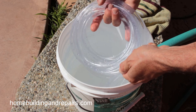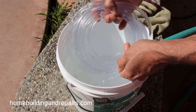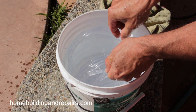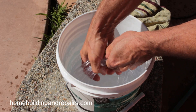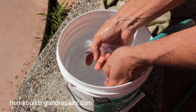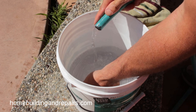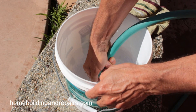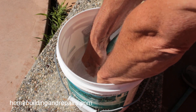Plenty of air bubbles — we do not want air bubbles in our water level. So after you get a little bit of water in the bucket, it wouldn't be a bad idea to submerge the tubing into the bucket. You can grab both ends and see water coming out, but you're going to want to submerge the hose and the tubing in the water to make sure that no air is getting in. Sometimes if you just hold it together, you're going to get air sucked in there, but if you put it under the water, there's a good chance no air is going to get in.